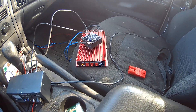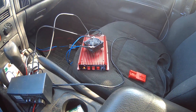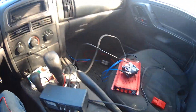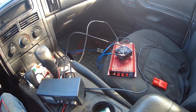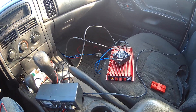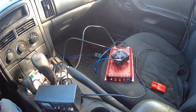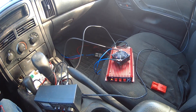Your system needs to handle double the power requirements that you need. This box runs approximately 25 amps on the high side, so the system can handle 50. That means when it's doing 25 amps, that 50-amp system — the connectors, the fuse holder, all of it — is just coasting along. It's like driving your car at 50 miles an hour versus 100 miles an hour all the time. Electrical supply systems are the same way — you have to have double the capacity so you don't get wires hot and nothing melts.